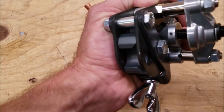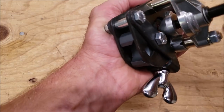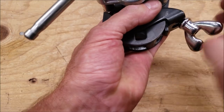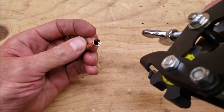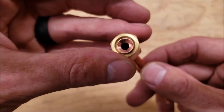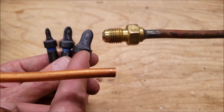There's no automatic stop on this one — you just turn it until it gets tight, then back it out and loosen the wing nut. The flare comes right out from the back. Here's your flare from the deluxe process flaring tool — it looks pretty good and takes up most of the surface area inside the nut, so that's a good flare.